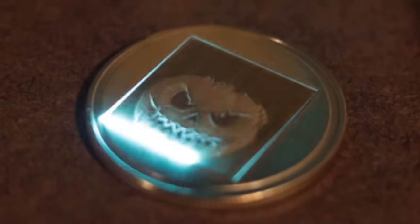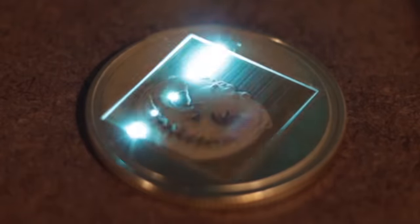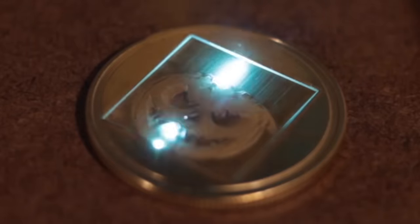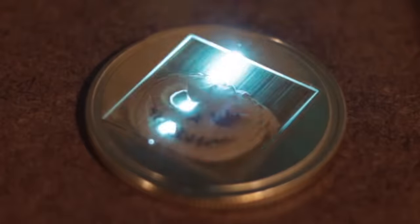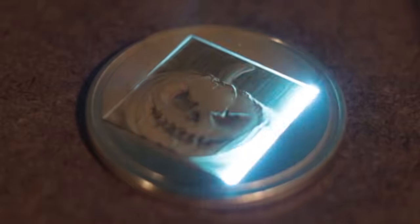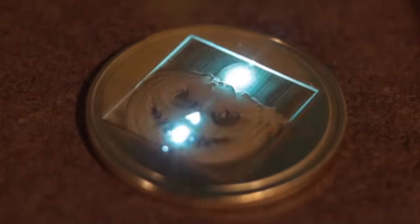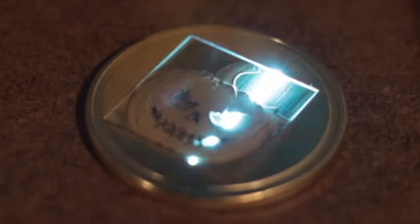As things progress here, you may see what I was trying to describe earlier. Each shade of gray, or color out of 256 available shades, is assigned to a pass, or layer. This assigns that grouping of shades, or in this case shapes, like a snapshot, to a layer to be engraved in the proper order. So as we dig, you'll see that the laser begins skipping over areas that are higher up in height, where the material has already been cleared. The next layers, or passes, will basically have a new snapshot to engrave from the old, based on what range of shades are assigned to that layer.